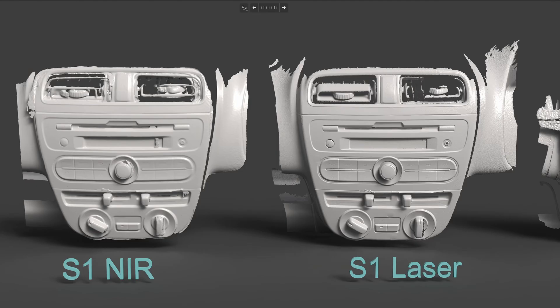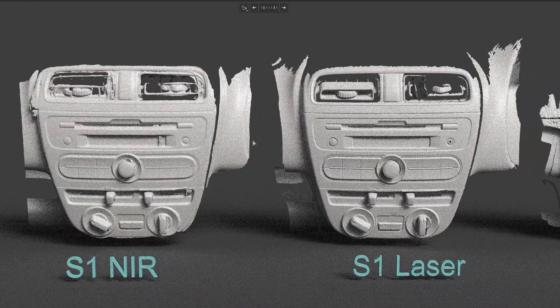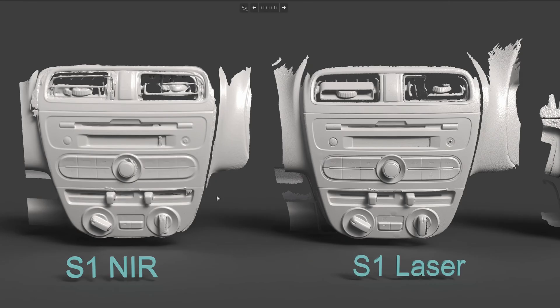Geometric tracking can give you a higher precision error of up to 0.3 mm, while laser scanning with markers has a much lower precision error — about 50 microns. So if you want to do part fitting, I would recommend sticking with marker scanning. Without the marker, you never know how much your scan has drifted — it could be 0.3 mm, it could be 0.5 mm, depending on the shape of the object. Some laser scanners from other brands have a markerless scanning feature in their laser mode, but the results I've seen from those are even worse than infrared scanning. Thank you for watching — I'll see you in the next video.